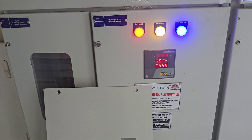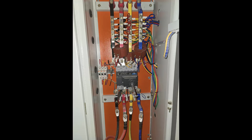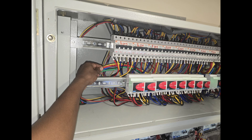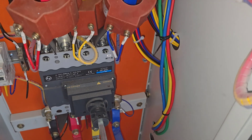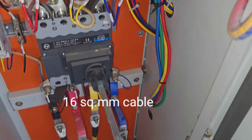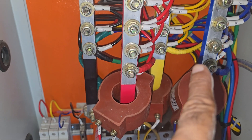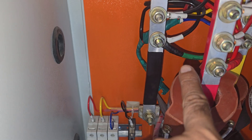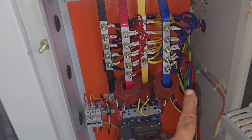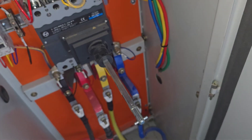This is the meter box, and here you have the bus bar. You can see the 16 square millimeter cable coming from the mains and connected to my meter. You can see the difference in thickness — the thicker yellow wire, the thicker blue wire, the thicker red wire, and the thicker green wire from the bus bar. From there, these cables are routed through this tunnel to my meter.